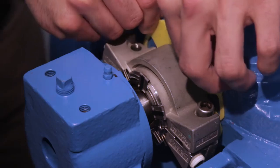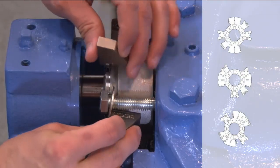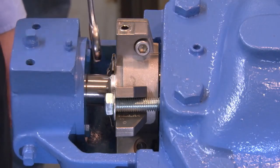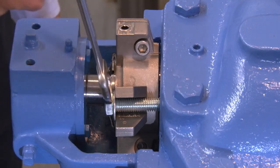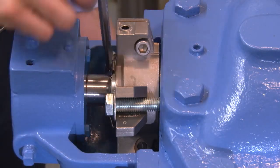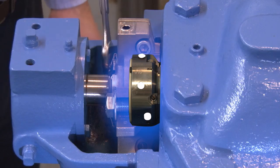Carefully remove the installation tool. Install the adjustable gland tabs as needed for a 2, 3, or 4 bolt pattern. Evenly snug the mounting bolts to the stuffing box keeping the seal perpendicular to the shaft. Do not over tighten the bolts. No centering of the 442C cartridge split seal is required. The internal centering buttons will center the seal automatically.